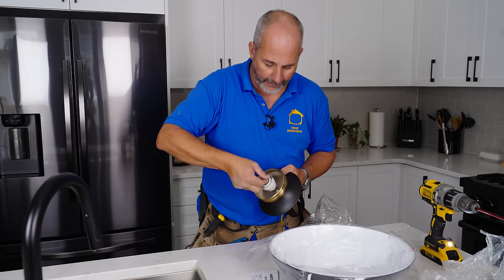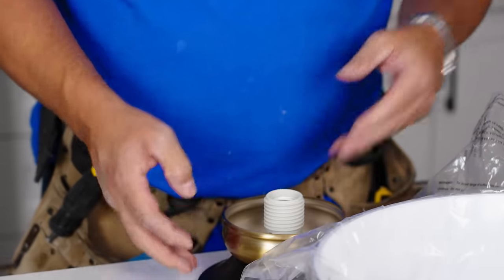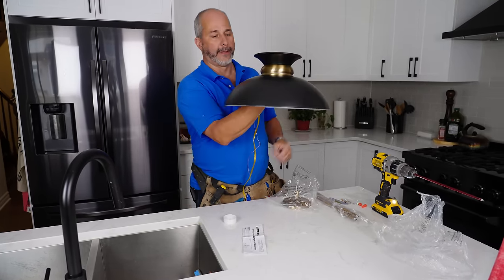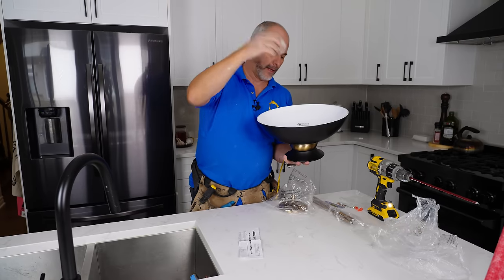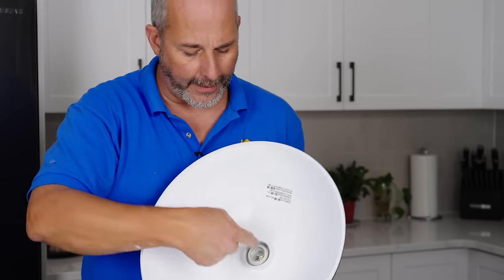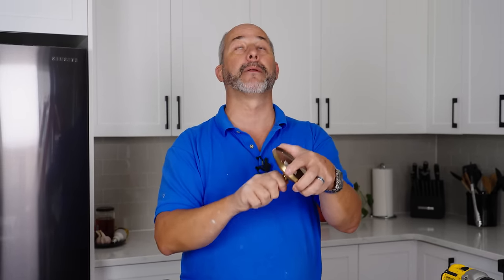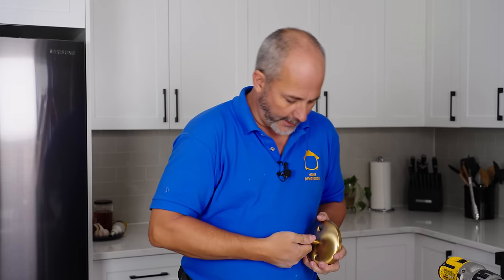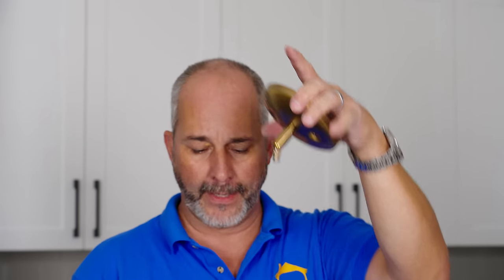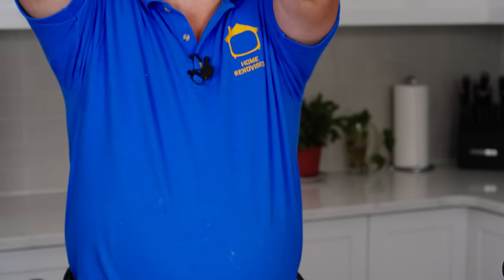You'll also notice a porcelain ring cap — quite common in bathroom lights as well — it's actually for mounting the shade. That'll get mounted eventually, and then you put the metal ring back on to hold the shade in place, then add your light bulb. The mounting plate goes over the octagon box in the ceiling. In this particular model it can be adjusted for a vaulted ceiling. The wire gets threaded through the hole, comes out, you do your wiring, slide it up, and mount it to the ceiling.